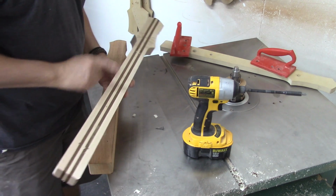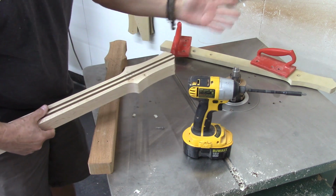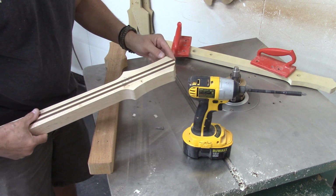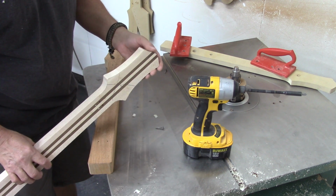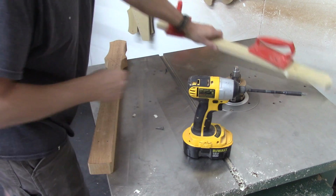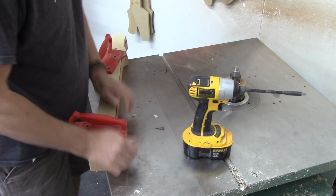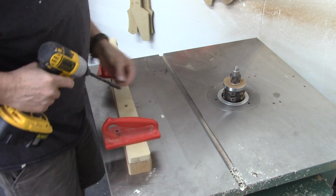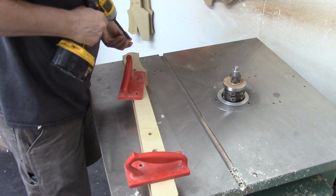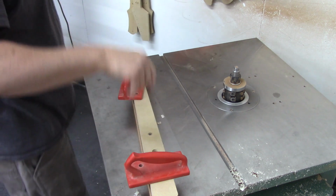I got to tell you, there's a little bit of a pucker factor when doing 5-piece necks like this. I had one blow up on me on the shaper one time. I think it was because the woods didn't want to glue up properly, but fortunately this torrefied maple glued up real nice. So no big shake there. Doesn't mean I don't always remember it though. I could probably do this with just the little indexing pin, but having a couple screws in here, just to be sure, makes me feel better.